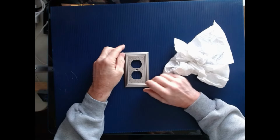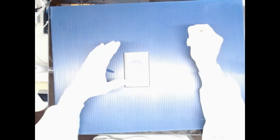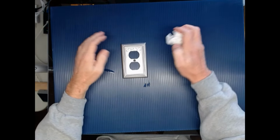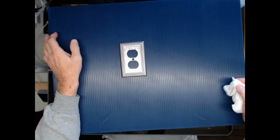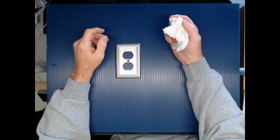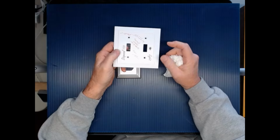But like I said, this was nickel. Just a word of caution, do not use PVC plastic. If you engrave on PVC plastics, it releases poison gas in the air and it's not good for you. There are other kinds of plates that aren't metal. There's these kind here.